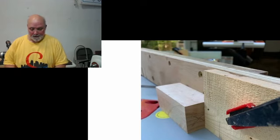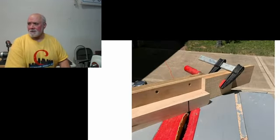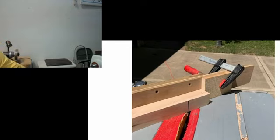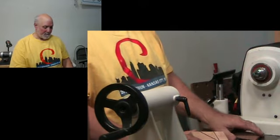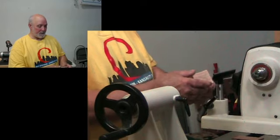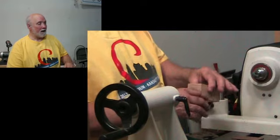Number 13. This is where I think I've got this one set at a 45-degree angle and making my first cut, which is the same as this one when it comes out. And I like to cut it short by about 1/8 of an inch. That keeps stability in my piece. I find that if I cut it totally in two, I have trouble getting it to line up.